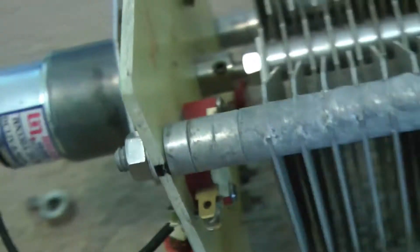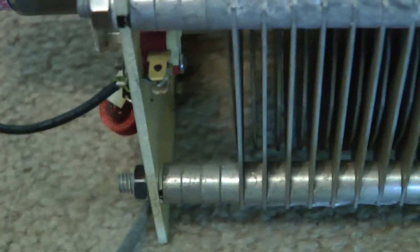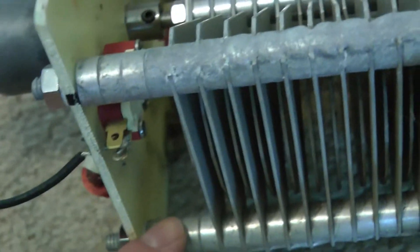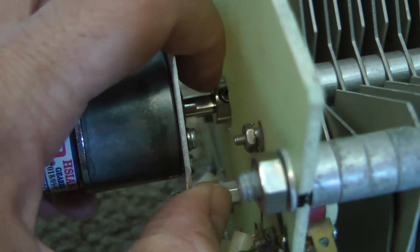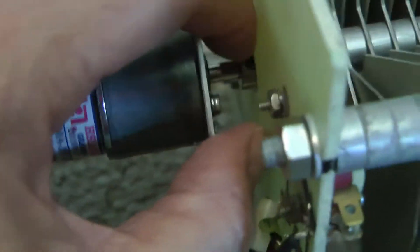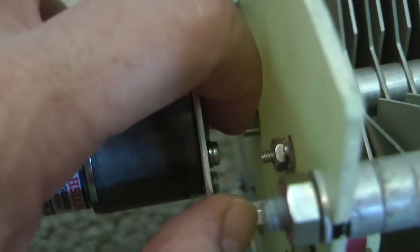Another thing: if you're tilting the antenna like this, these little spacers will just slide right off, so you gotta be careful not to let those slide off. It doesn't hurt anything, just make sure you put them back on. So anyway, I took all these nuts off and I drilled on this side and that side so this little attachment to the shaft can turn freely in there. You can make it any size — a lot bigger or whatever. I just barely cleared mine; I wish I'd drilled a little larger.